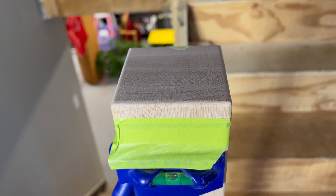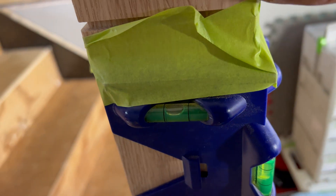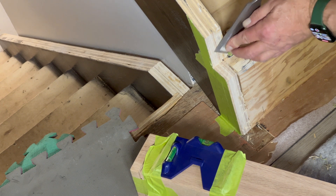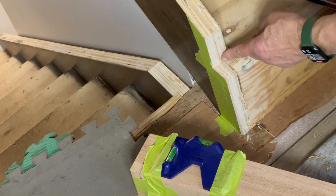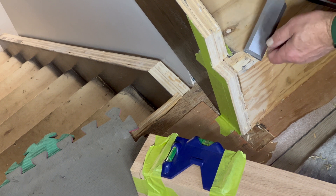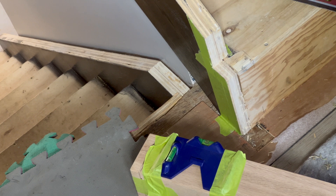I'm going to do some fine adjustments, but that is pretty good — pretty happy with that. On this side I'll just tighten up the top screw a little more, and that'll pull the post into plumb. I had to do a little bit of chiseling and shaping just to get it really nice, but the most important thing is it's going to fit real solid onto the staircase.